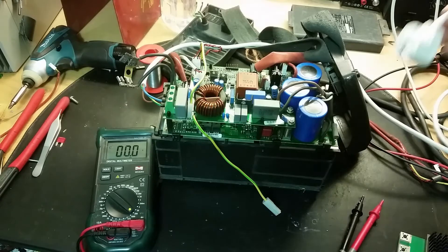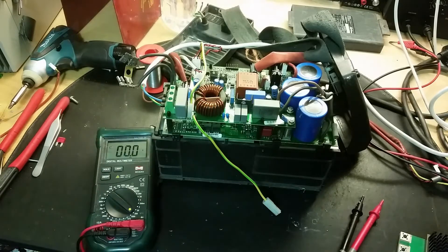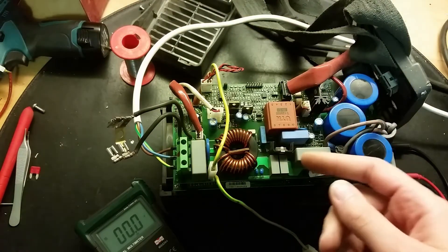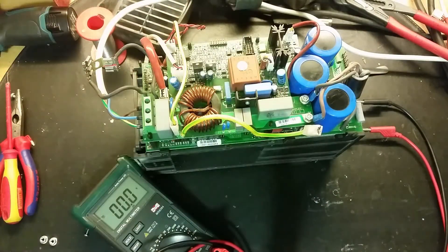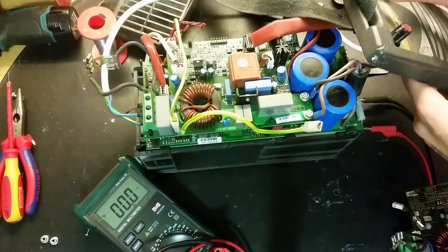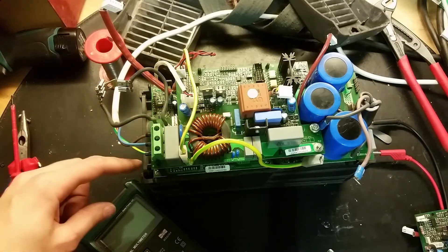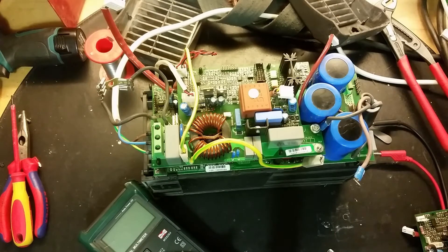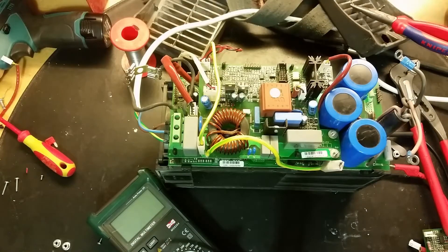Let's plug this in and see if it explodes - three, two, one. The fan turned on. So maybe the top board on this one is faulty; I'm going to change the top board and see if it works better. Let's now change the top module - here's the old one. Plugging in the display and the controller - nope, it does nothing. Now I've unplugged the bottom board - let's see if the power supply turns on and the fan rotates. No, it does absolutely nothing. Now I've disconnected the wires to the capacitors - still nothing.